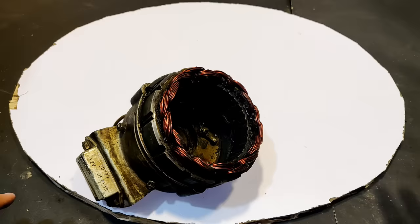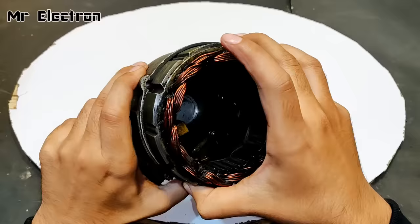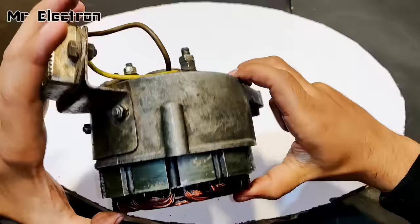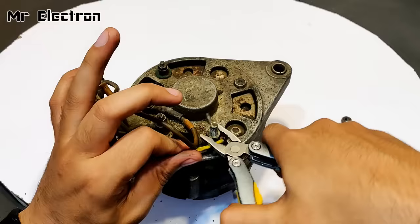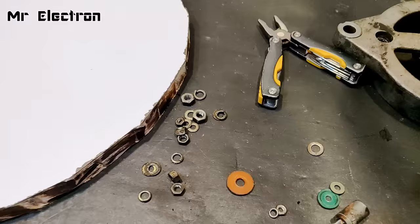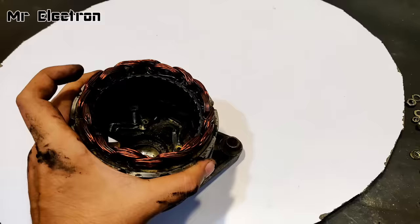As you can see, the top portion of this armature winding is clean but the lower portion is still pretty bad — it can only be cleaned after I remove the base. After cleaning, it has got a pretty good effect on the windings. All the screws, nuts and bolts have been removed, and now the armature winding is out from the rectifier and the base of the alternator.